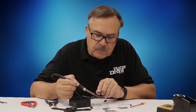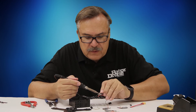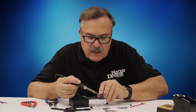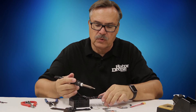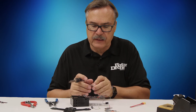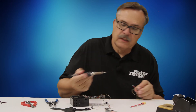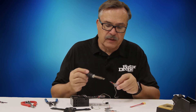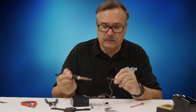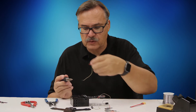You put this down and it's on there — just like that. I'm going to do the same with this one and press it down. You can see how fast that solder works — it basically happens right away. By having the iron hot, having some solder on the tip, fresh solder rather than solder that's been on there for a while, and having solder on the wire — once you touch it down, everything heats and transfers very quickly and solders right to it. That's the best way for soldering onto a board like this.